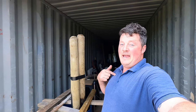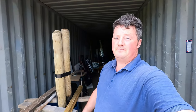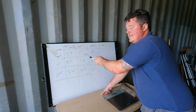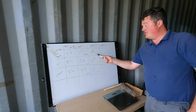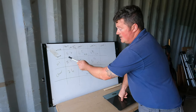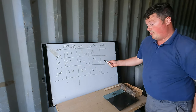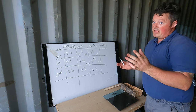Another week has passed. The standard post started at 5.7 kg, gained 0.8 kg after week one, then another plus 0.2 — total after two weeks: one kilogram. The oil post started at 5.1 kg, gained plus 0.3 then plus 0.3 — total: 0.6 kg. It's still absorbing moisture but at a slower rate — about a third less.